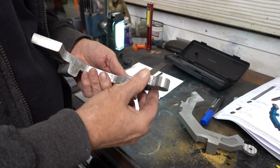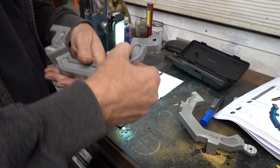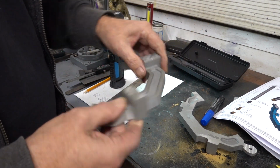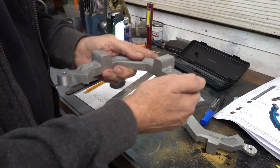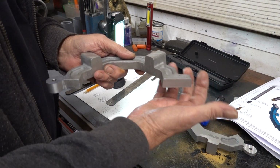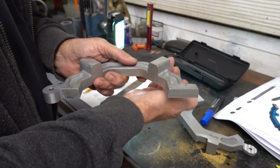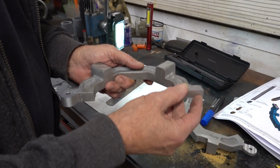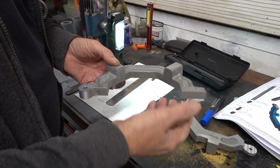There's just a bit I'm adding into the video, so I'm not leaving you out of anything. I didn't show doing those, but it was just a case of put it in, mill that and mill that, then turn it, mill that, then same again. To get that bang on right, I brought the milling cutter in till it touched, and then went back, set a zero, went back out, came across, back in again, set a zero, went back out and checked, and it were okay. It went out a little bit, I tapped it around and nipped it back up, and I clamped it again with two clamps.